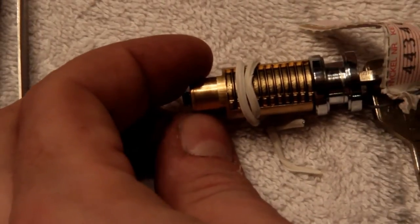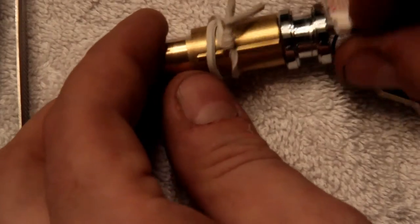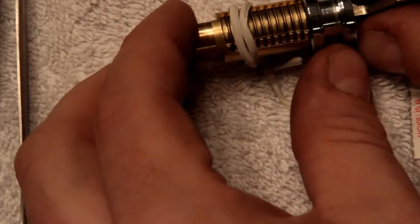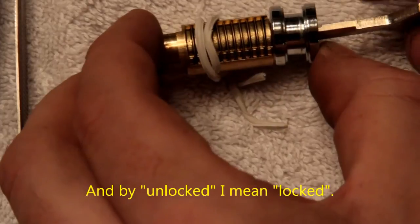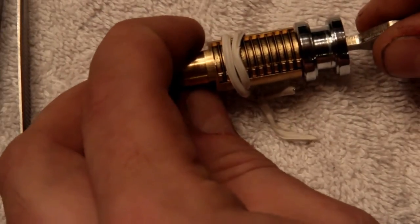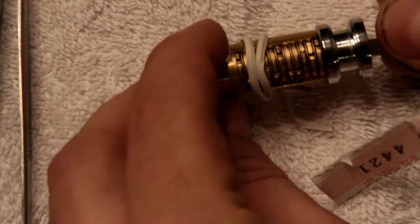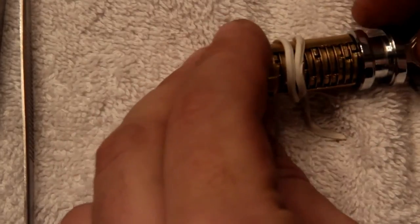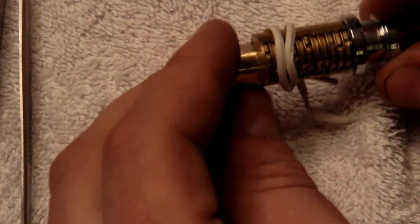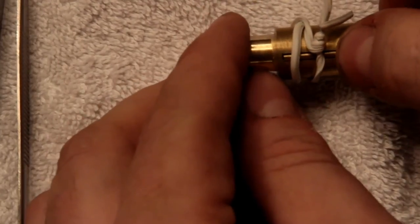There's the top. Each disc has little spacers, and each disc has a notch at the bottom that lines up with the sidebar. This is the unlocked position, so I can take the key out — I'm not going to remove it all the way. You can see how much of the key is blank up until you get to the bitting. And then when you turn this, the first 90 degrees or so moves all those little wheels. When those are all aligned correctly, the sidebar can go in.